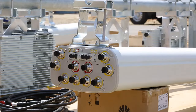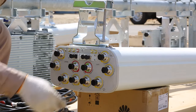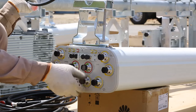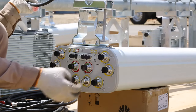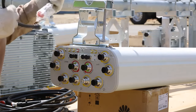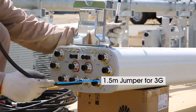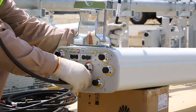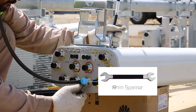First, we will go through the installation steps for 3G 2100 MHz frequency. The antenna should be placed on a flat surface and precautions should be taken to avoid any antenna damage. Connect the 1.5 meter jumper for 3G to the antenna and tighten with a 19 millimeter spanner.